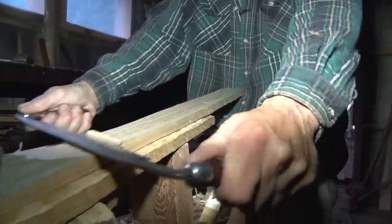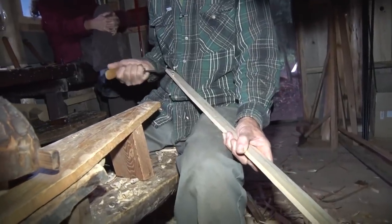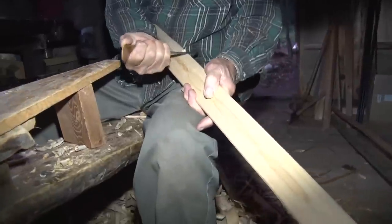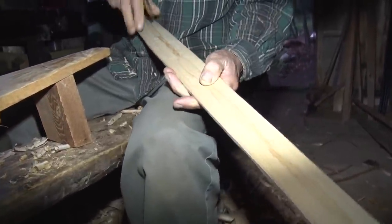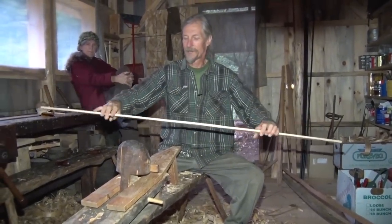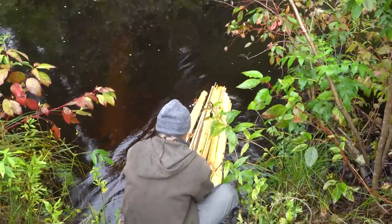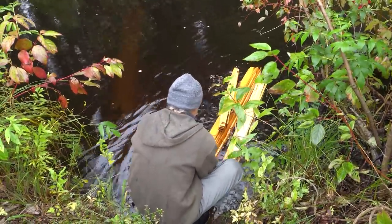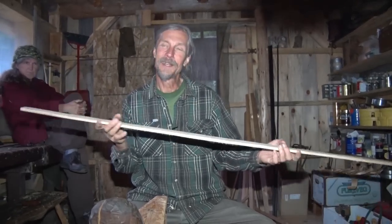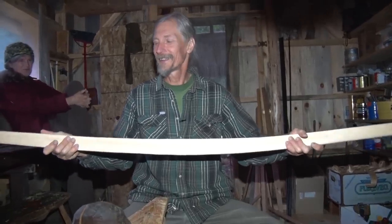Get the bottom flat and I can bring the top down to it. Doing a bevel, just so when you're pounding the ribs in it won't just split off the edge. It makes it a little bit easier when you're dragging stuff around in the canoe. Here's the test — if it feels like that, it's like a big piece of spring steel. Then when I give it the hot water treatment, it'll be marked for the width of the bottom of the canoe where it's going to go. When this is done, take all 50 ribs, tie them in a big bundle, and throw it in the river. One year at the river, we had a big rain and washed all my ribs away. I had to spend the next day in the canoe going downstream finding all the ribs. That was the day off — caught some fish too.